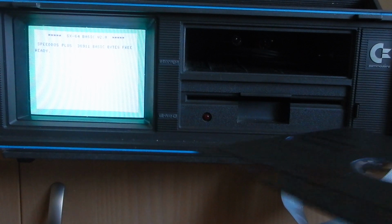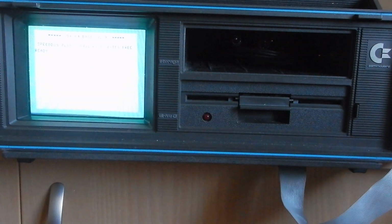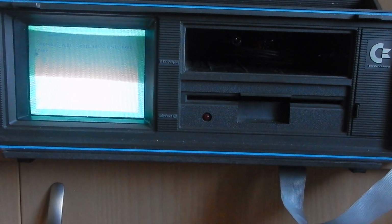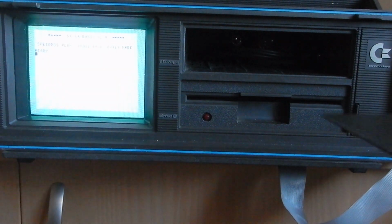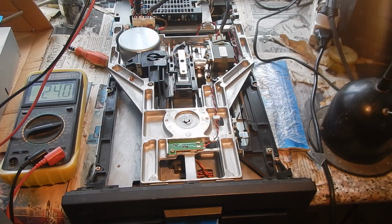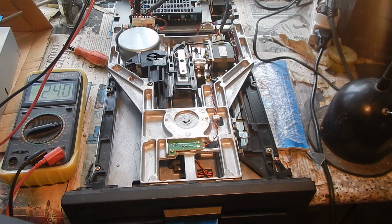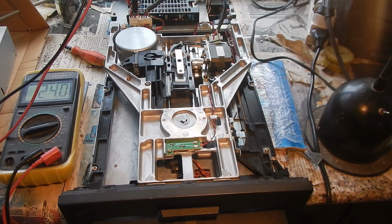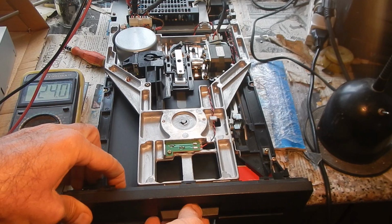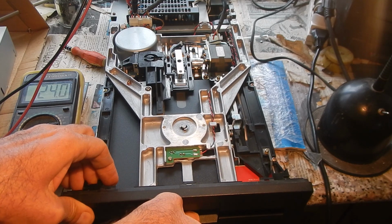This is important to allow the clamp to center the disk correctly when closing the latch. In fact, even before the 1541C, the SpeedDOS ROM for the 1541 that many of us installed back in the old days would start the spindle for a few seconds after a disk insertion. And even this big 8 inches half-height drive starts spinning as soon as a disk is inserted. Most of the older 8-inch drives had AC spindle motors that were always spinning whenever the drive was powered on.